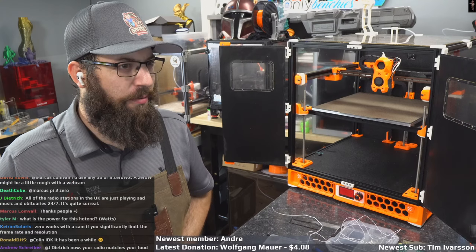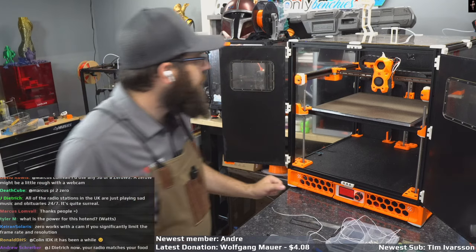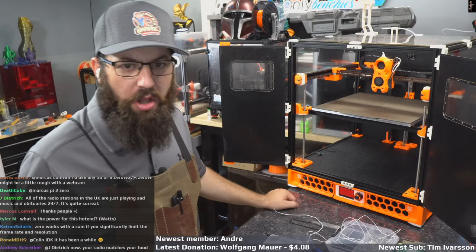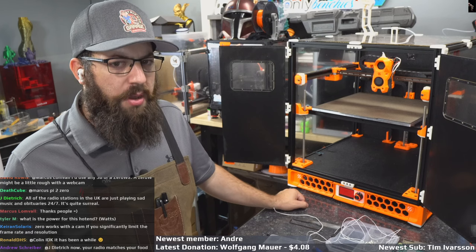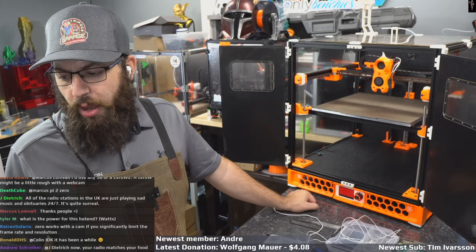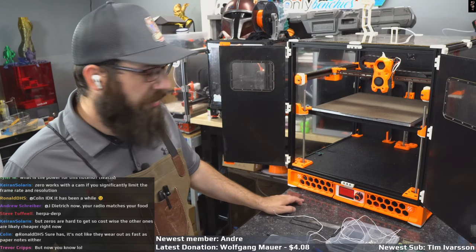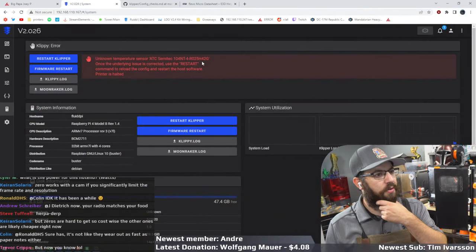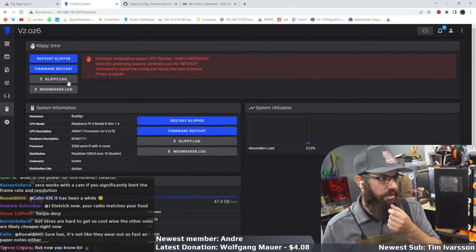That explains so. Well, actually, it doesn't explain anything from our research. And for those that don't know, anytime you install a new hot end, be aware you will smell like an oily burning smell for a little bit. Usually there's greases and oils that get on hot ends when they're being built. The first time you heat them up, that burns off. So now you know. See, this is why I didn't use 104 NT on here, because it gives me an issue. Or maybe this is just such an old version of Klipper I'm running on here.